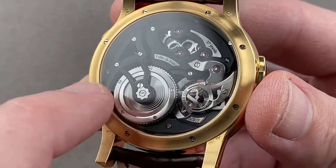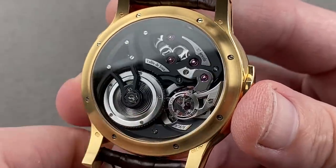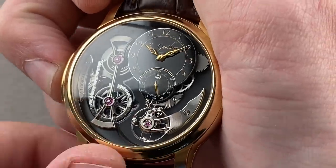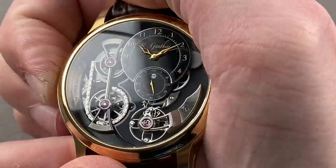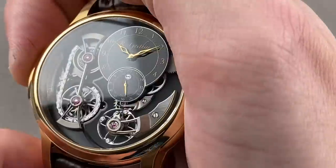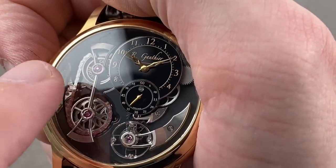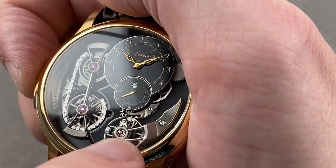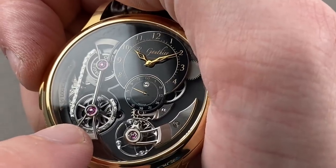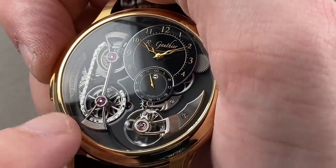The interior of the barrel, as well as its cap, is sapphire — so there's very little friction on the mainspring inside the barrel. There's a power reserve indicator. It is a manual-wind, 46-hour power reserve, and there's a stop-works so it will not tell time when it has too little energy to tell good time. You start winding it by pressing the trigger at nine o'clock. It's an interesting free-sprung balance architecture. Both the wheels and the balance are of Gauthier's own design. There is a snail cam with a fusee and chain — the barrel drives the snail cam, the snail cam is attached to the drivetrain, which goes under the grand feu enamel dial and drives the escapement. For the 46-hour power reserve, you get constant amplitude about the balance because as the barrel winds down, it pulls a larger effective diameter of the snail cam, increasing mechanical advantage to maintain constant amplitude even when the barrel is relatively discharged.